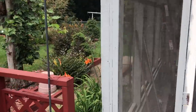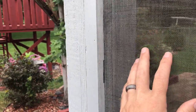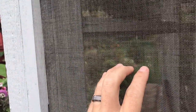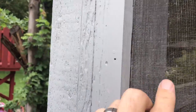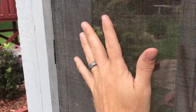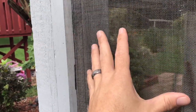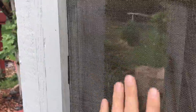I'll lastly just highlight, a lot of times the reason we're replacing screens is because it's aluminum mesh. This is actually fiberglass mesh, and you can typically tell fiberglass mesh when the hail hits it. It's got these little tiny holes from where the hail hit, versus aluminum, which is dented and bent, right? So this is a more cost-effective mesh, so this would be a lower price. This is the same mesh that's typically in the Florida porch enclosures. It's called a pool and patio fiberglass mesh screen.